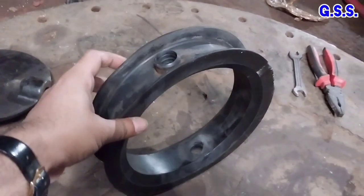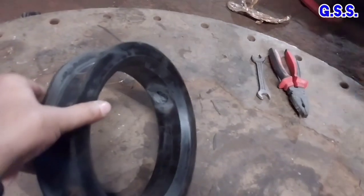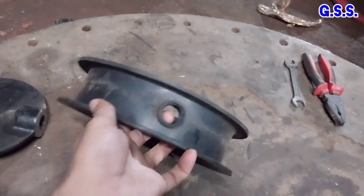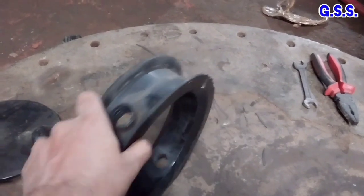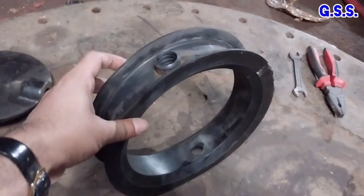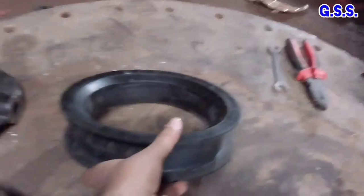This is 3mm thick flexible rubber sleeve made of EPDM or nitrile rubber as per valve body inner dimension, which will be used as valve body rubber liner. It is having two holes, one for upper shaft and another for lower shaft.